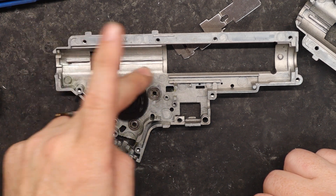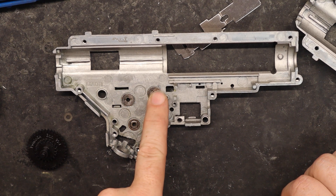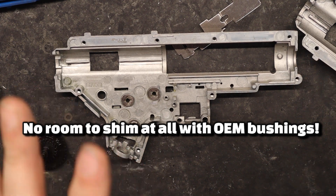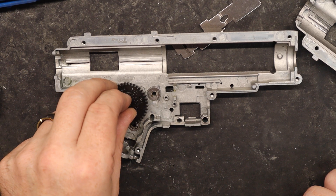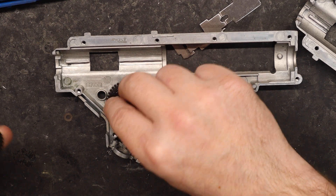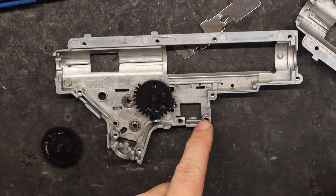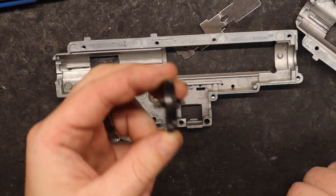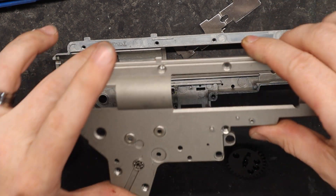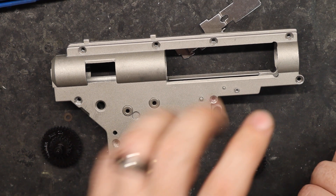When you put Pandora gears inside your SEMA, the teeth will rub just barely on the bushing because it's raised up and not flush with the gearbox. In this case, since I had the tools available, I used my mill to make this bushing nice and flush because I don't intend on spending much money upgrading this test bench. I also found that there is absolutely no wiggle room to shim the sector gear in this gearbox — these Pandora gears bottom right through the top, so when you put your gearbox shell on it almost binds on the gears, though it can still free-spin once screws are in.